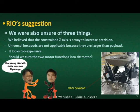He proposed to boldly eliminate all the linear and radial guides that restrict the unnecessary motions. Instead of serially stacking each stage, he proposed to arrange 6 motor-driven actuators in parallel. And he combined those motions just through simple joints, and finally produced 6 degrees of motion. He asked for my comment, but I felt a little jealous because he tried to do something I failed many times. So my comment was very negative.